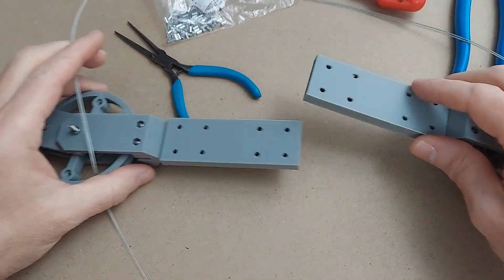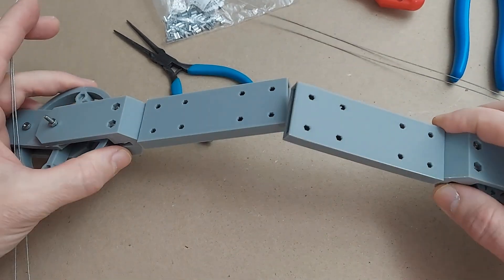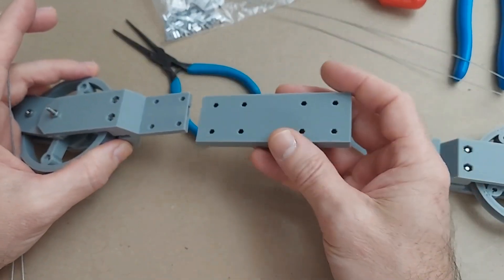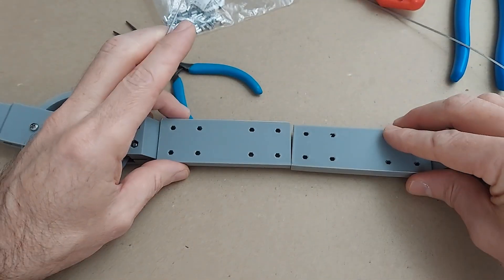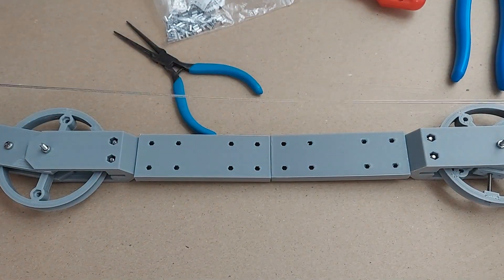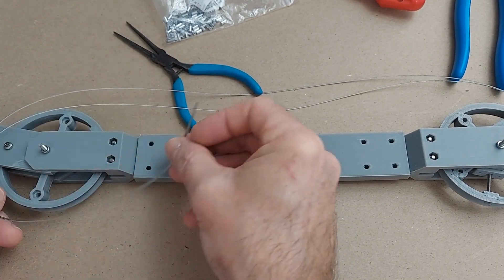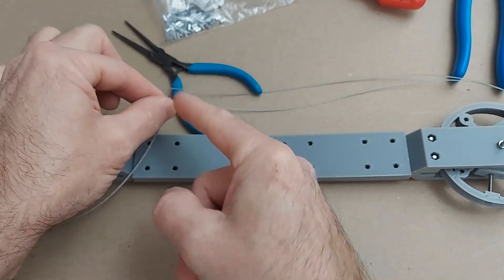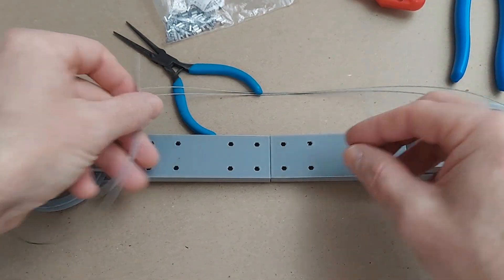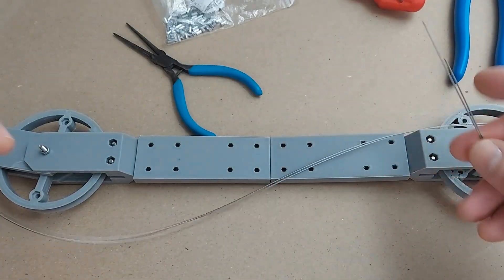You need to have enough cable to cover the thing you're trying to build. I want this to be in two parts so I can rotate it and do all the flexible stuff you saw me doing. I've got these two pieces of square channel that the cables are going to pass through. I've measured the cables by wrapping them around the pulley to come back on itself, cutting there, and doing the same on the other side — giving me some extra slack, so I've got plenty of cable to come all the way up through here, go around, and through the little channels.